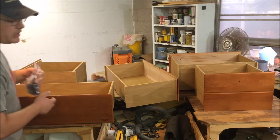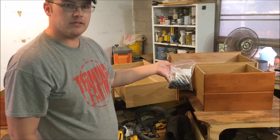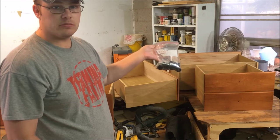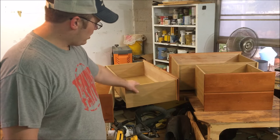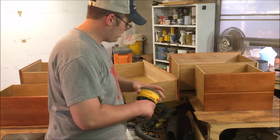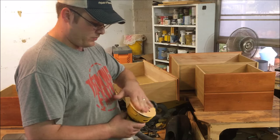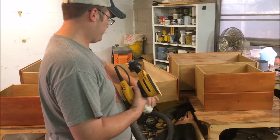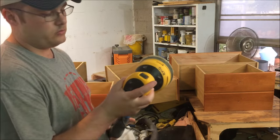The first thing I did was take off all of the drawer pulls. Any time I do that I just put them all in a zip lock bag to keep track of them so you don't lose them — store those in a safe place. Now I've got to sand all these down, not a lot, just really enough to get a good bite for the paint. I've already got 150 grit on my sander, so I think that's a good grit to start with. I'm just going to hit everything to 150 and then we'll start painting.